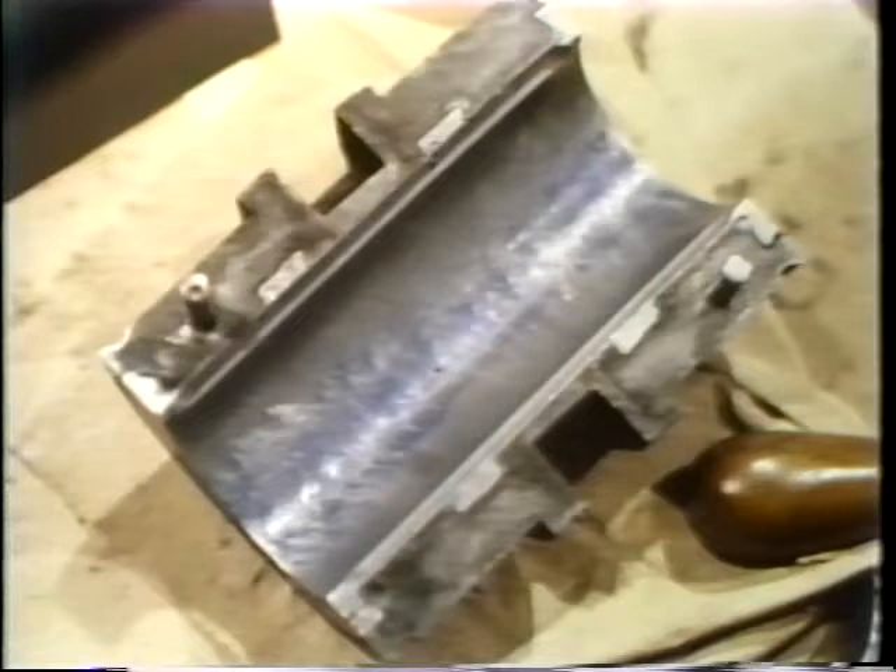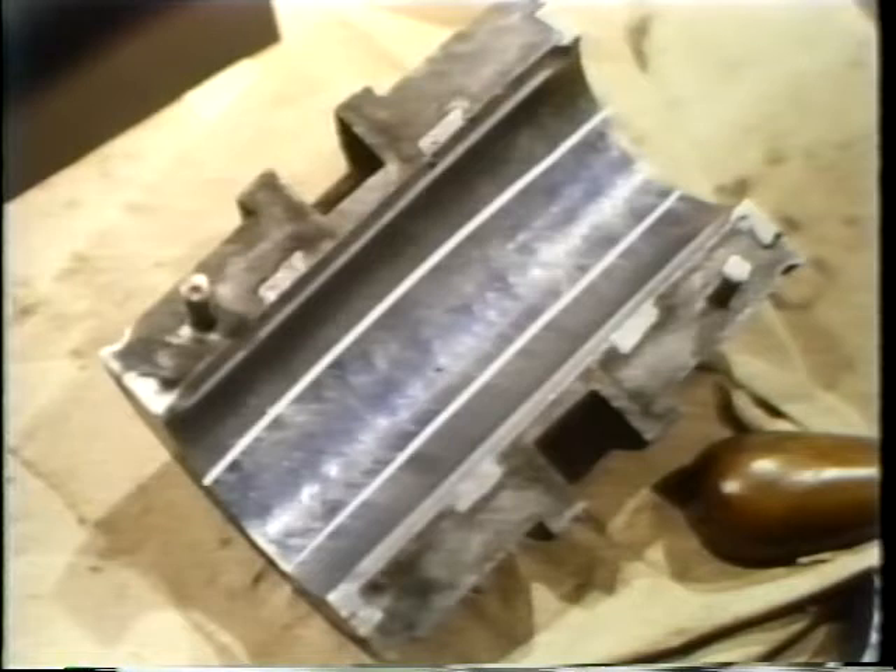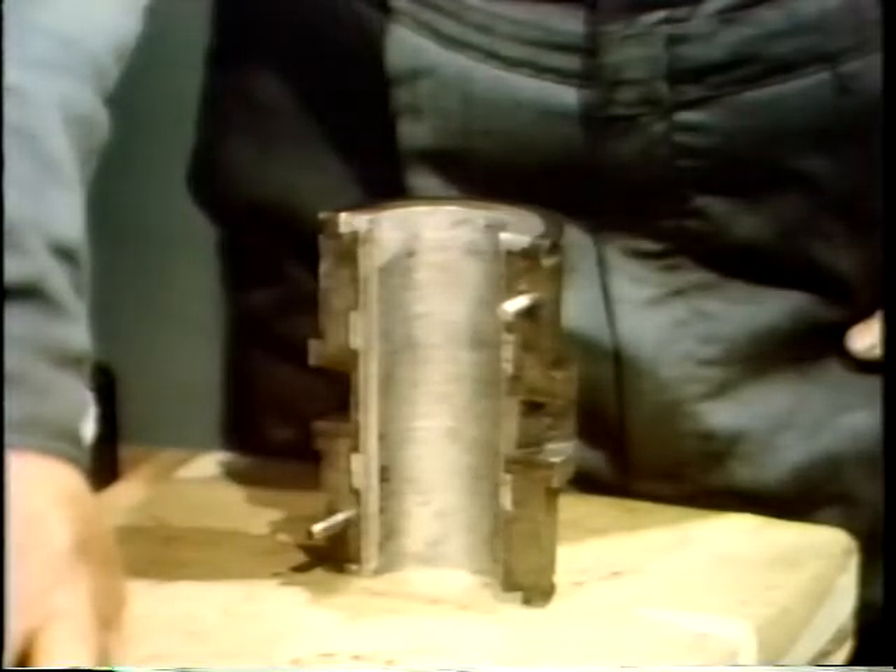What is an acceptable dye pattern? It's coverage from one end of the shell to the other. You'll notice that coverage is not all the way up on the diameter of the shell — recall what was discussed earlier about oil clearance or running clearance: the shells have a larger diameter than the shaft. So the only portion of the shell covered with blue dye is the portion actually in contact with the shaft. This check can also be performed another way: the two bearing shells can be assembled around a mandrel of appropriate diameter to check contact on both shells. The worker chose this method because he suspected high spots on the lower half and wanted to check alignment of the bearing housing with the shaft — and he found proper alignment.